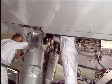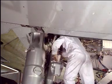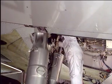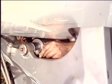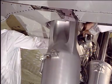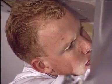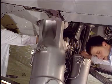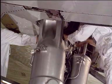Remove the top cover to gain access to the bell crank. Remove the through bolt securing the shortening mechanism bell crank. Drive out the inboard part bell crank lever.